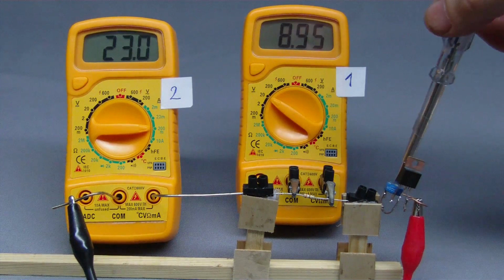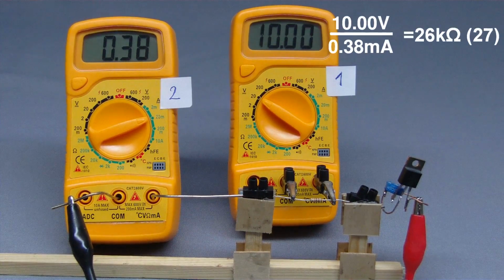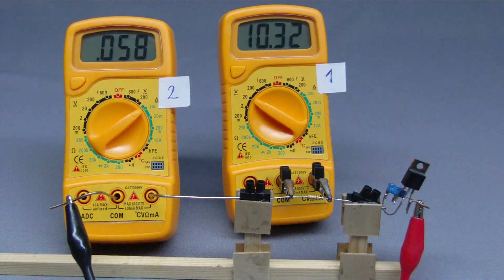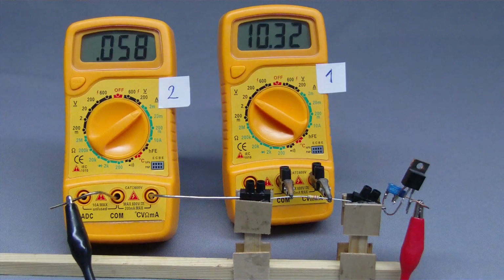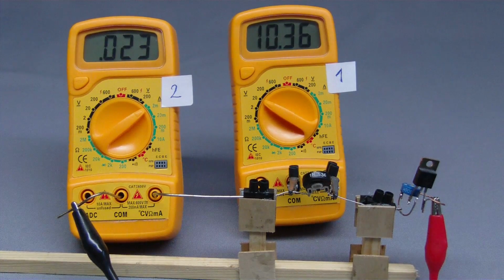With the help of this arrangement, we can analyze the resistance of several devices while exposed to different voltages. This arrangement of the two multimeters leads to considerable deviations while determining devices with a high resistance. The inner impedance of the voltmeter is high but not infinite. Consequently, an additional current is running through the voltmeter, which is detected by the ampermeter too.